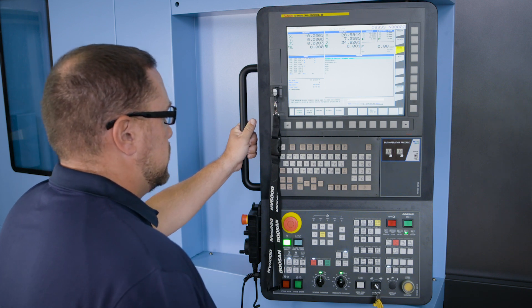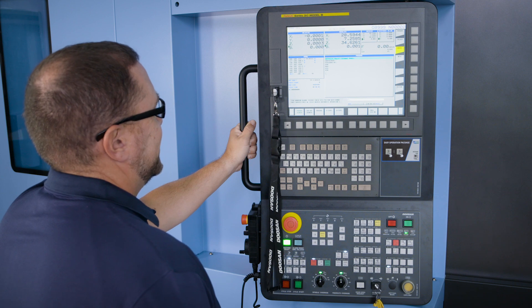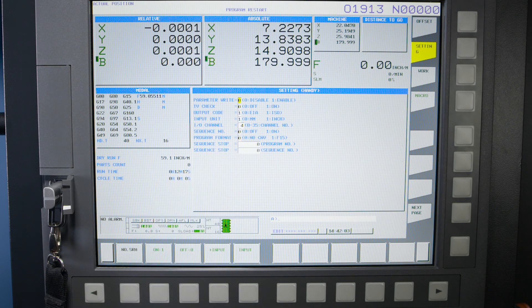So what do we need to do? First, I'm going to send my full backup to a USB stick. Let's make sure our IO channel is set to channel 17, which is for my USB stick. If it's not, I'll show you right here how to change it. Let's press the offset hard key twice — this will pull up our offset page that shows what channel the machine is set on. Here we see it's on channel 4, so I want to change that to channel 17.